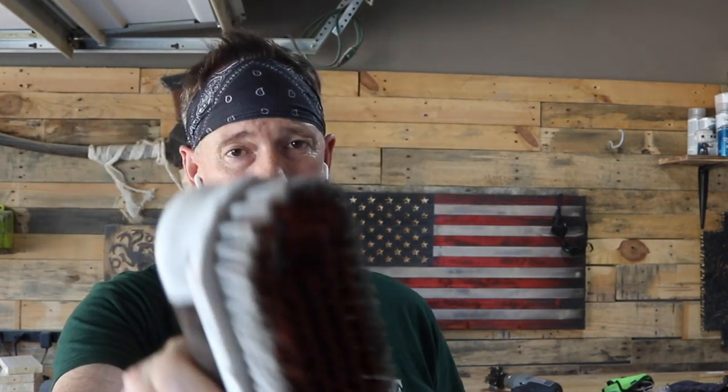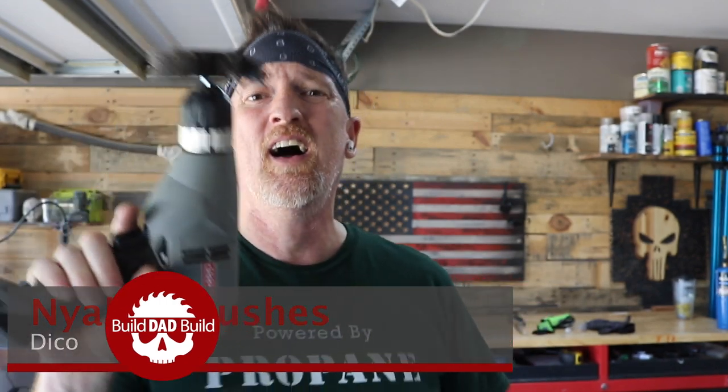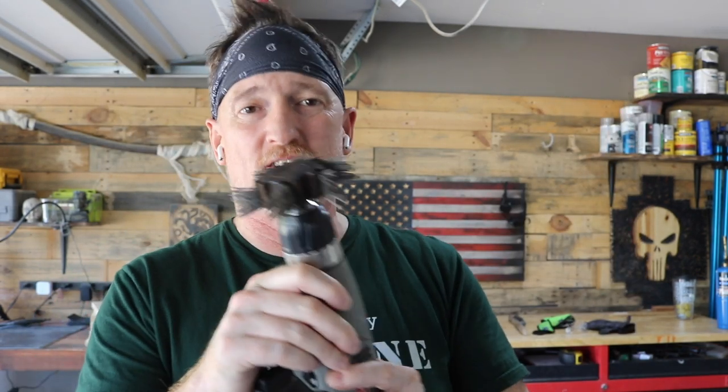When I made the original video, I was still removing char with this bad boy, a wire brush, and this bad boy, which is basically a toilet brush or a bathroom brush. Most of the time you don't want to see the tool marks, so you want to stick with nylon. But we've got upgrades. Since that time, I found these Nylox brushes that fit in your hand drill. These will save you so much time. I will link to these down below as well, because these right here are what dreams are made of.